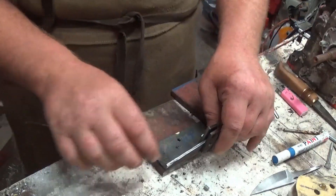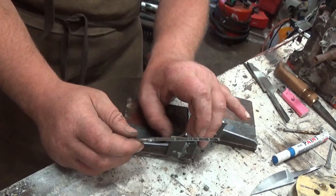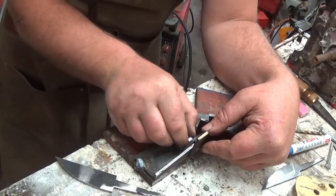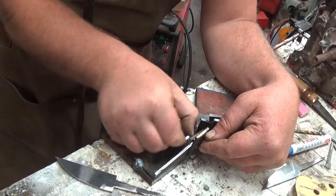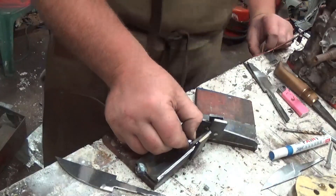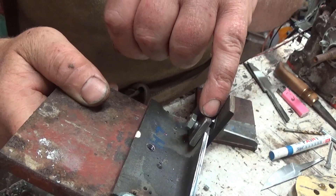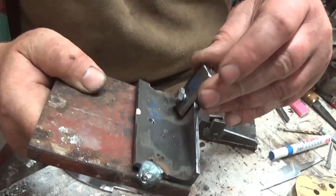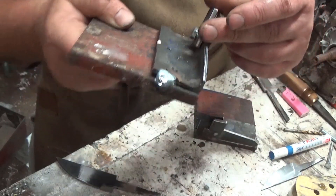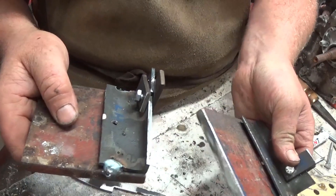The whole point of these jigs is there's a matching pair, so I get them in exactly the same spot every time, and it gets the ricasso perfect on the back - this bit here. Take that nut out all the way so you can see it a bit better. Very simple - a bit of angle iron. We've got a shape cut out of the piece of angle iron, and you can see a step there - that's what the back of the blade butts up against. And then this is the clamp. The clamp also doubles as a stop, so it goes up to the platen that I made on the bench grinder. These are set at a specific angle - the only vaguely tricky bit was getting these angles the same accurately.